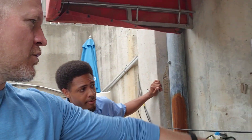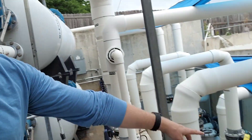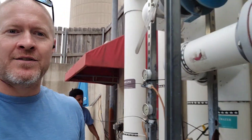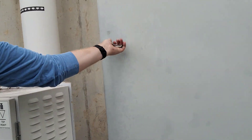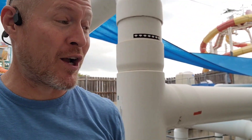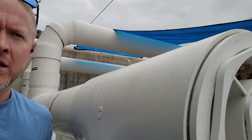I'll give you a quick overview. XPC, two bleach pumps because this is a pretty big facility. You see plenty of horsepower down in the pit. Our current sensor is down over here. And just for demonstration purposes and confirming that it's all connected properly, I have the flow switch jumpered because we don't want to shut down his system without him here, and we can't install it without drilling into the pipe.